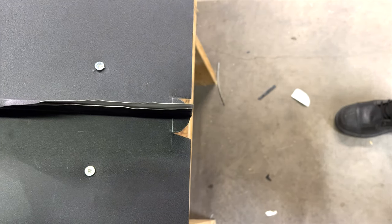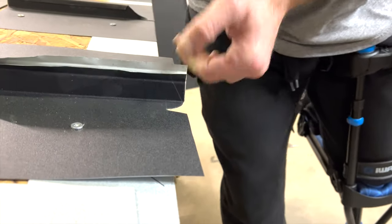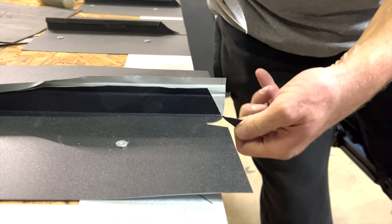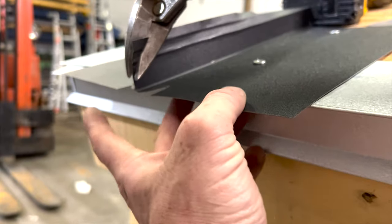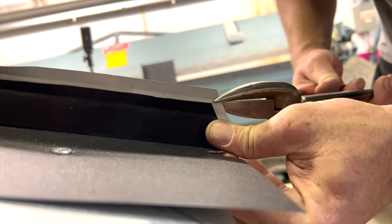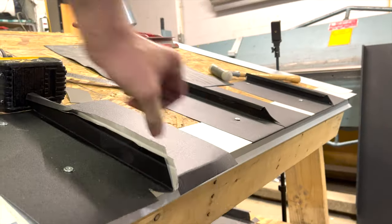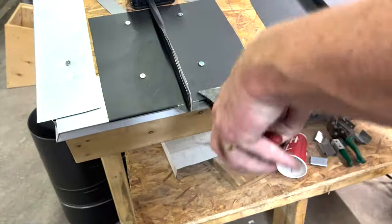Taking off this little chunk of material is quite important to the finished product — you don't want any loose metal hanging around. These notches here that we made on the jig: the importance of being accurate with the notching, I cannot stress enough. It sets up the playing field for the rest of the detail — where the bends are going to bend and so on. So make sure to practice your notching and get it as accurate as possible. First you get good, then you get fast.